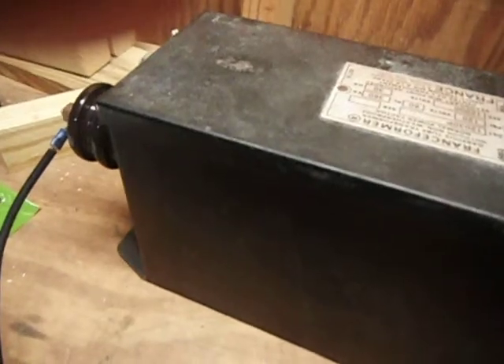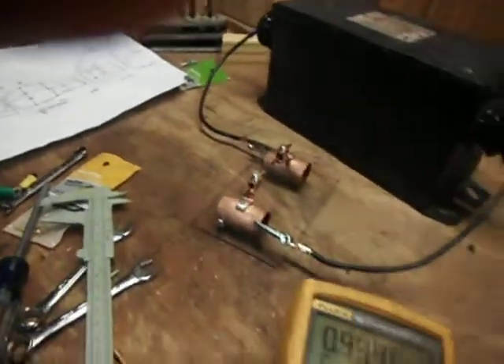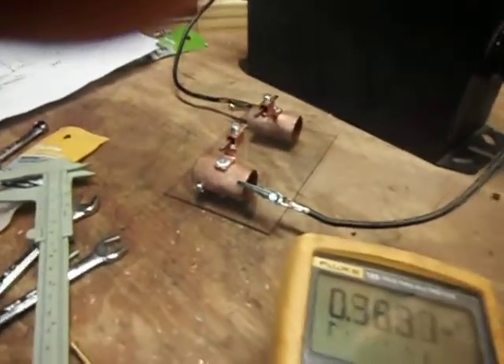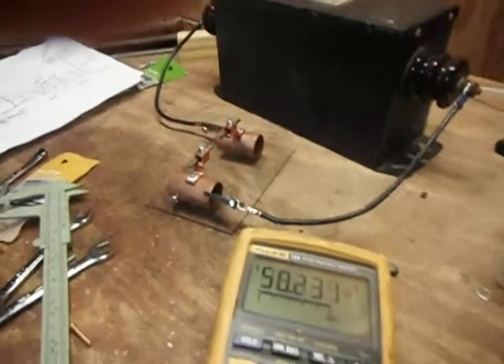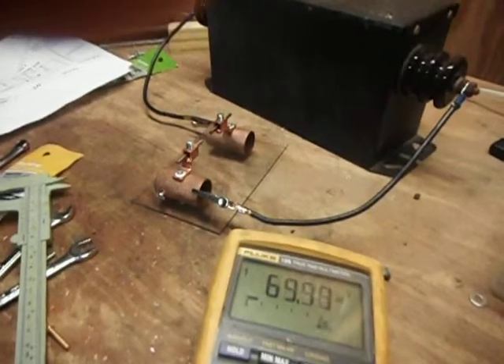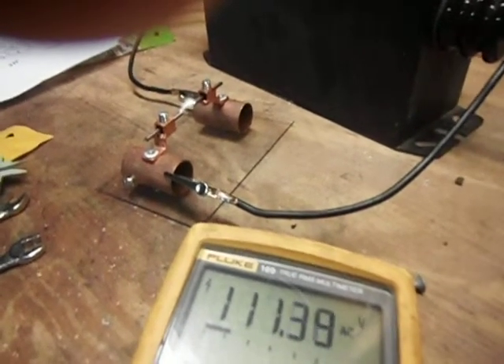Right now I have it measured with a caliper — it's pretty wide, right at about 1.3 millimeters. I guess that's normal for 12 kilovolts, but I can't find any data on it, and I don't want to go any wider than that. Air starts ionizing at about 70 volts — you can hear it buzzing. It's on right at 111.